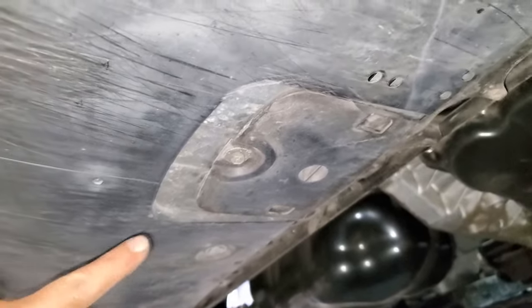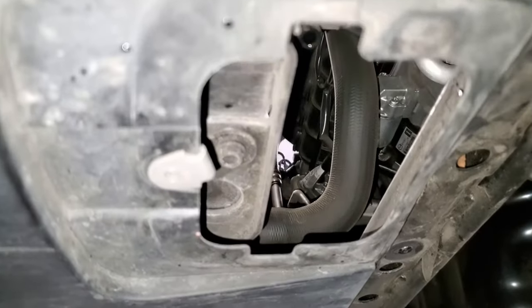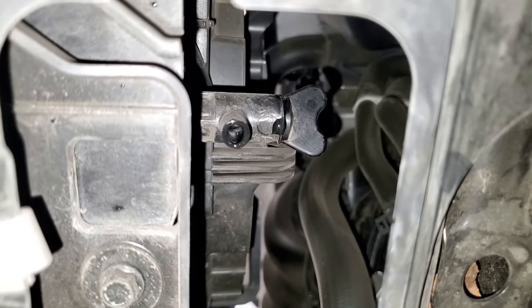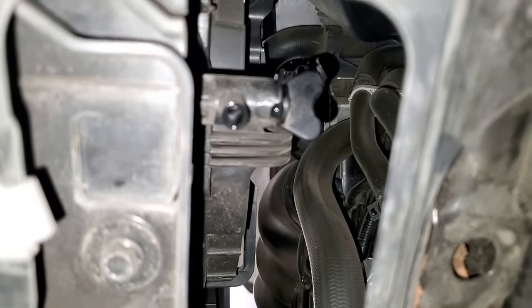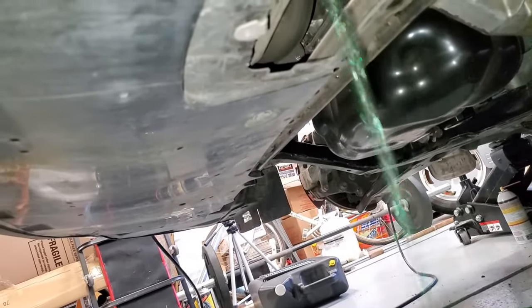In order to drain the radiator, we're going to open up this viewport to get to the drain plug on the bottom of the radiator. With the cover removed, I want to show you what the valve looks like underneath — that's the drain plug for the radiator. The wing portion on the right-hand side is the valve. You basically unscrew it counter-clockwise until the fluid starts coming out. Once the fluid is done draining, close the valve back up. To dispose of the coolant, do not throw it into drains or storm drains — take it to the dump so the liquid can be disposed of properly.